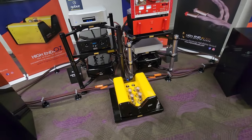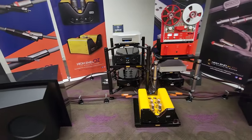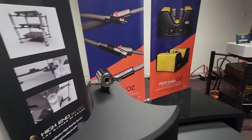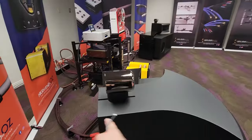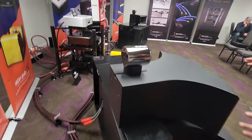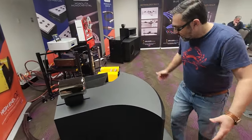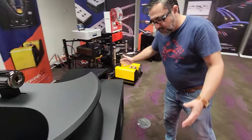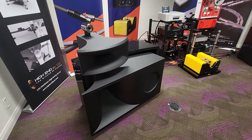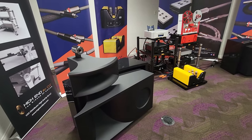So it's basically an active type, or is the crossover in the... the crossovers are inside the speaker. And there's a super tweeter here. You can time-align it — is that what this is for? Exactly. You can time-align it, plus the horn itself. This part can also be moved, and the bottom section can also be moved, so time-align.